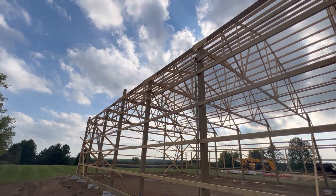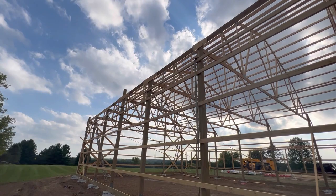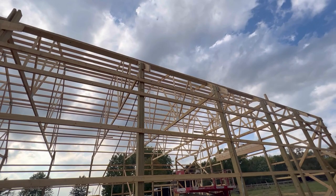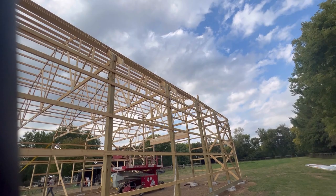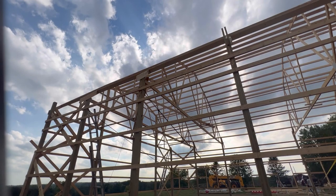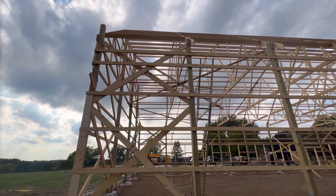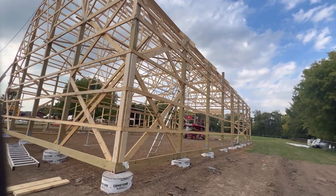You can see where we've got our rafter tails. There was a question — maybe it was on one of Matt's videos — about why we didn't get these built in. Anything over 40 feet we'd have to go to a two-piece truss, and I really wasn't interested in that. It's not that big of a deal to just sister on a two-by-six for these tails rather than going to a two-piece truss, which would have been a lot more work.